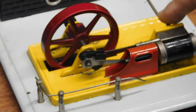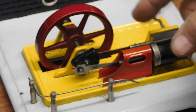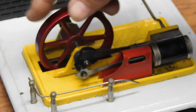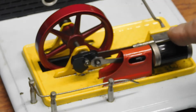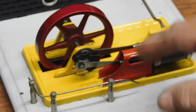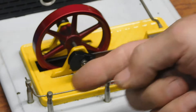The steam comes in, it pushes the piston, the piston comes out, this rod comes out — or this valve comes out — and then when it comes around again, it's venting the piston to the atmosphere. When it gets up here, steam comes in and it pushes. So now it's the steam working against the piston on one side — it's always pushing one way. But it's a lot more efficient, you can develop more power, and it's a lot lower on friction than the inexpensive style. So this one gives you a constant movement in one direction.